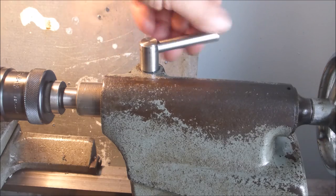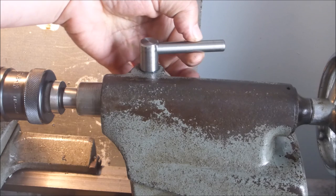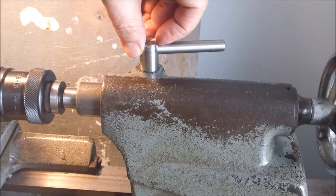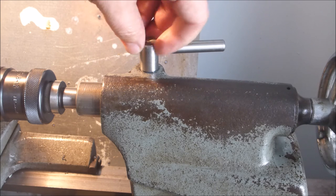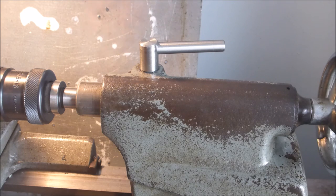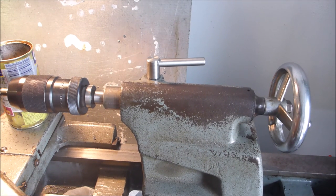Yes, that's what I made, and it does the job just great. Feels good. This is a thousandth over 3/8, and then I drilled, and then rather than ream, I actually used a 3/8 mill to make a good true bore here. Pressed it in, and does the job. And I like it. I think it looks fine over here on my big ugly 12. And I'll keep the pretty one over there on the 10. Or excuse me, the 6.